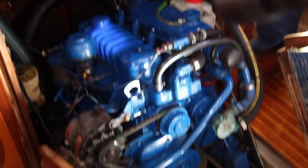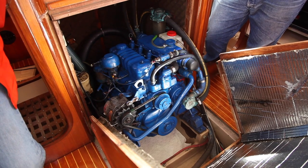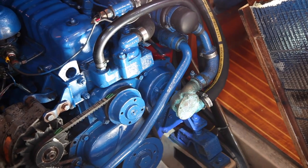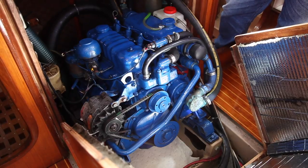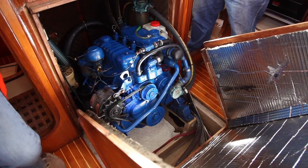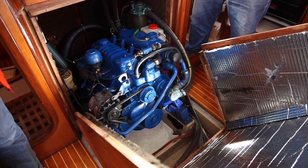About once a year, drain out and replace your coolant — half water, half antifreeze, just like in your car. The seawater impeller: if it's gone a whole year and you're not noticing any change in flow, just replace it. Transmission fluid should be done yearly. You should also check your shaft seal yearly. So: every 100 hours — oil, oil filter, primary fuel filter; every 300 hours — add the secondary fuel filter; and once a year — coolant, seawater impeller, transmission fluid, and check your shaft seal.